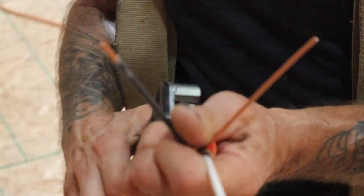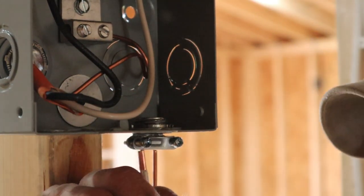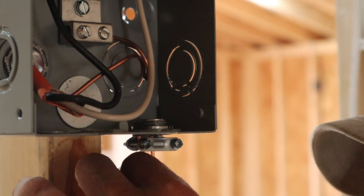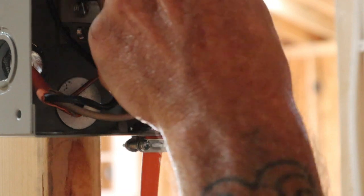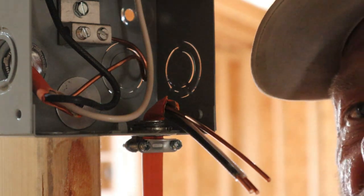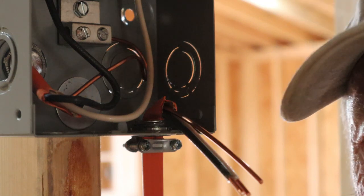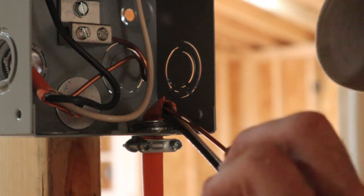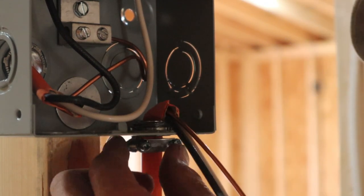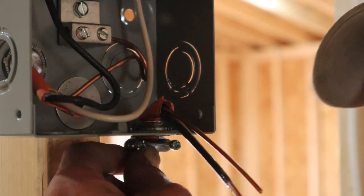Let's head back over to the quick disconnect. This time we're going to bring those three wires up through the bottom romex connector, because this wire will be going straight out to the water heater. Now, many folks might ask why we're not putting protective conduit around there — well, we would if this were outside. You'd typically use protective conduit for something like an air conditioner that needs to be weatherized. But in this case, since it's inside my home, the romex connectors are sufficient, and you want to make sure they're tightened down so the wire doesn't move and cause an arc.